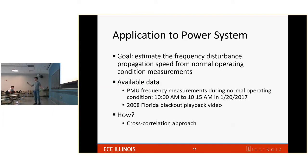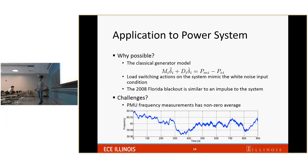So how? For sure, cross-correlation. If I didn't use that, I wouldn't have spent the past 15 minutes talking about cross-correlation. But before we do that, let's think, why is it possible? The reason is that for a power system, we can model the generator dynamics using the swing equation, and the swing equation has this form. And for a large-scale power system, if you put all the swing equations into the state space representation,